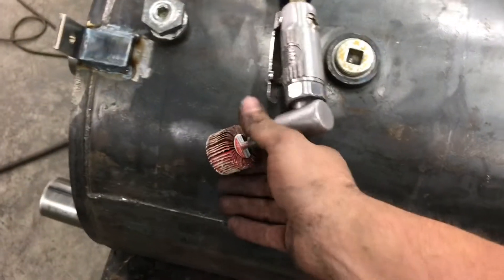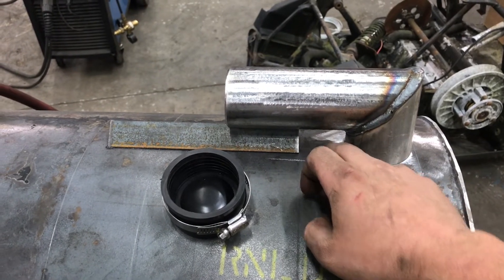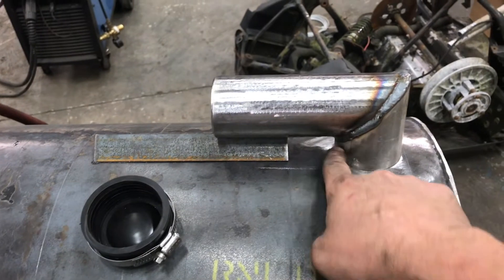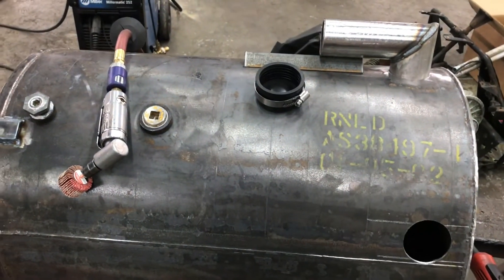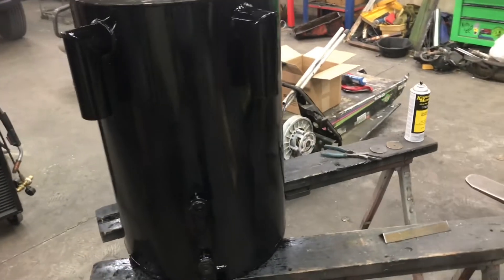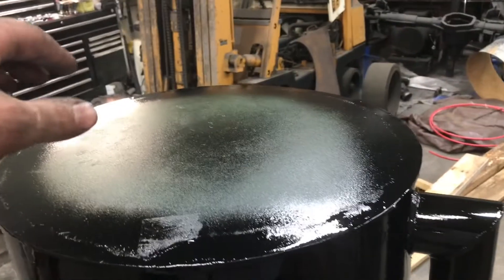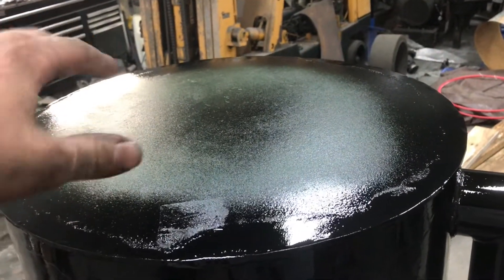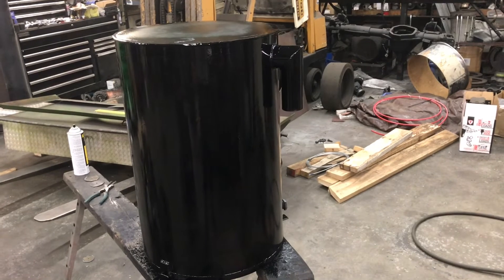Got our edge nice and cleaned up — went in with a flap wheel and a die grinder, removed all the burrs, cleaned the top. Using this piece of angle iron as a spacer gives me three-quarters of an inch — plenty of room for the Fernco fitting and to get the MIG gun all the way around. Now I've got to clean the other one up and get them both welded in. This is ready for paint. There's the first round of paint. Problem is, it's three o'clock on Friday, so it ain't going to be dry enough to put it in today, but I'll get another coat or two on it. I'm just painting it rough on top since I know I'm going to be grinding most of this off to put the lid on. I cleaned all the mill scale off the sides — that was a chore. Got her all cleaned up, first coat of paint. She's definitely going to be ready to put in by Monday. Thanks for watching, guys.